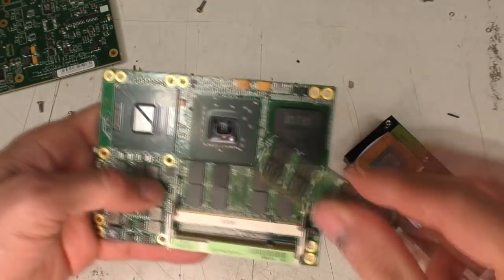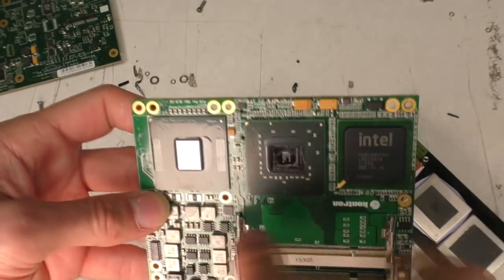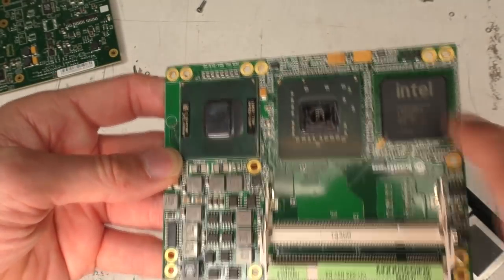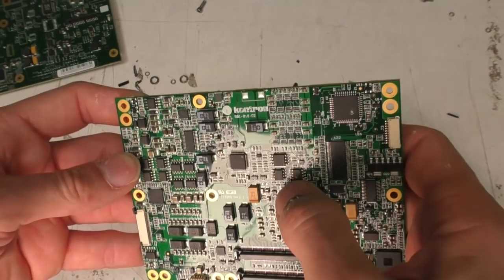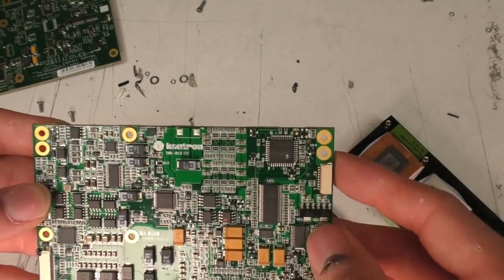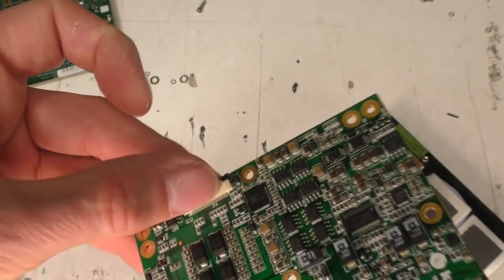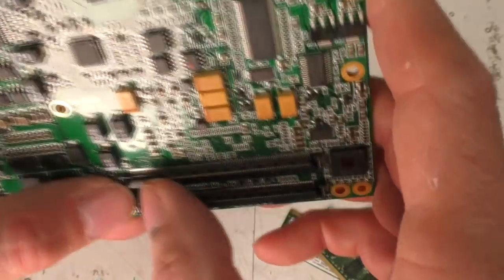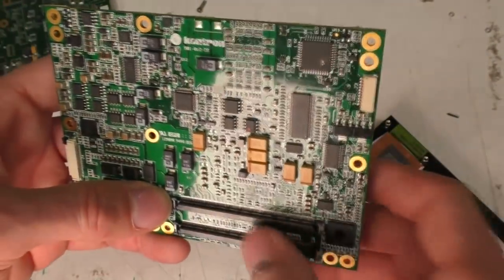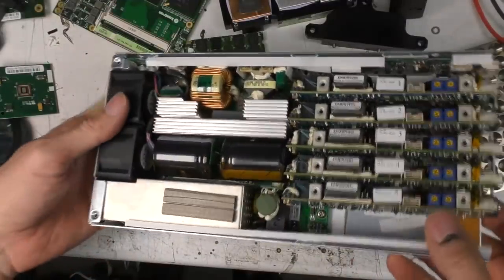There's 4 gigabytes of RAM on here. So we've got the main processor and the support chips, all the power stuff here, and just various support chips. There's even a PIC 12F508 there, and there's a Lattice CPLD there, just mopping up various logic functions. So there's that FFC connector. I'm guessing that's probably going to be for an LCD option, and obviously you've got very high pin count connectors here that basically break out everything that you'd want to connect to a PC onto your system.